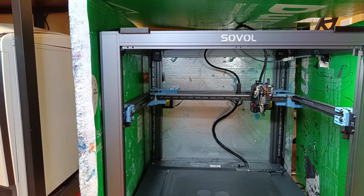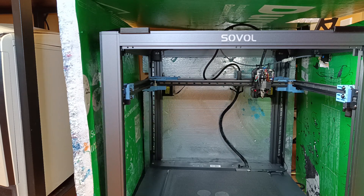In order to avoid filament delamination, I enclosed my printer with my makeshift styrofoam enclosure. Even though it has more headroom than the original Sovol enclosure, the wire hit the top, folded in, and got stuck in between the gantry. What's the point of a printer with that much build volume when something like that can happen? The print didn't finish anyway, so I hit auto home to start over. And what happened then is that the Bowden tube — which got dragged down by the wire — got stuck in between the printhead and the rear right corner, and got pinched. Not cool.